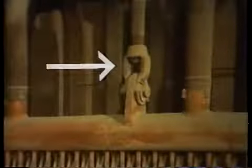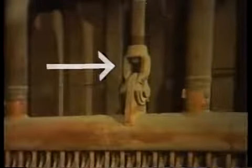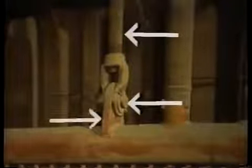Pay particular attention to the header supports when you inspect the upper headers. These supports hold up part of the boiler, so check the headers to make sure they appear level and in proper position. When incorrect, these are both indications of support failure. Watch for broken or loose hangers, loose attachment bolts, loose pins or straps, and broken attachment lugs.